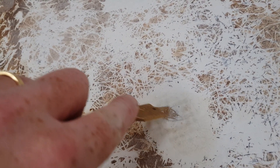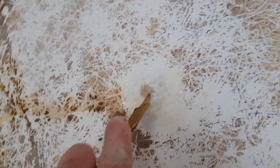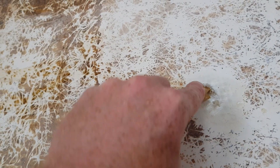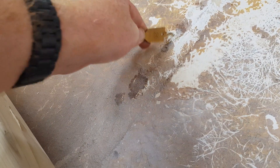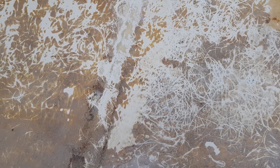I've got a nice convenient sharp thing here. All of this is going to have to be — oh there you go, see that? What you have to do is to remove the rotten glass and wash it through. The problem is the acid spreads — as you can see there's a real puddle of it here, and I haven't even begun to really have a proper look. There's more. This line along here I suspect is where the original stringer was.